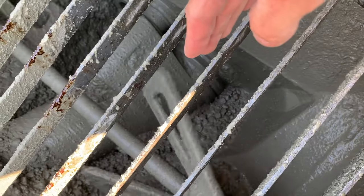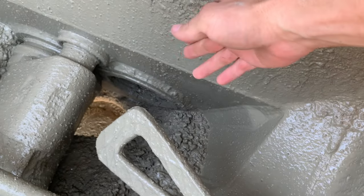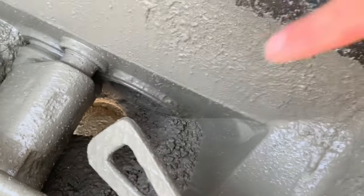What I'm gonna do is I wanna clean out the material cylinders. I'm gonna let this S-tube shift over. Once it's over on that side, I'm gonna lift this hopper grate up like so. What that does, it dumps my accumulator. It does let the pump finish off the stroke, bringing the piston cup, I should say, right close to the end of the cylinder. So now I'm gonna take my water, I'm gonna rinse out the cylinder on this side.